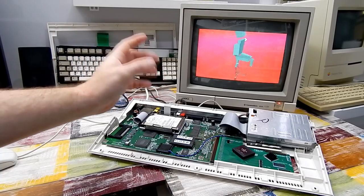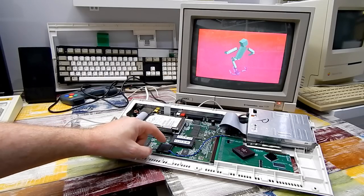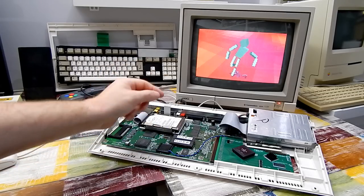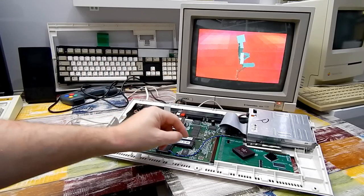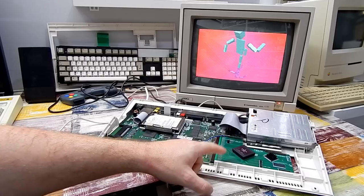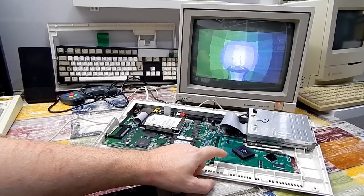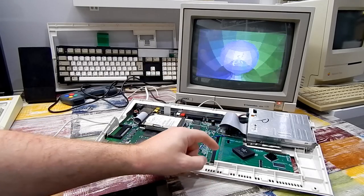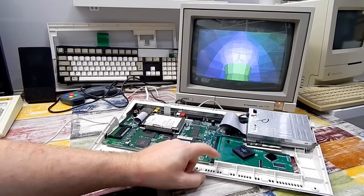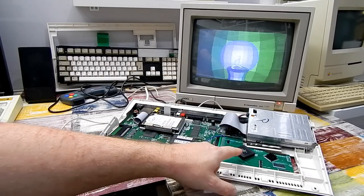So I'm thinking that the clock speed coming to this chip is just too much for it. What I want to do, just to try, is reduce the speed of our accelerator again. We have a 120 MHz crystal fitted to that, so let's take that off. We'll put the 108 crystal back on, and that will give us a clock speed of 54 on this chip